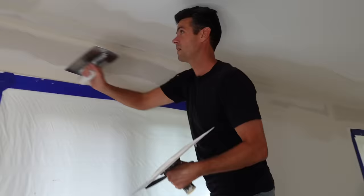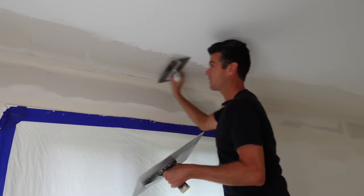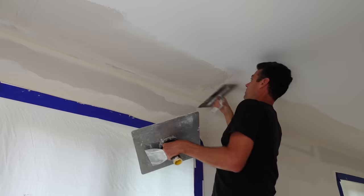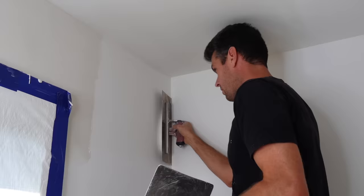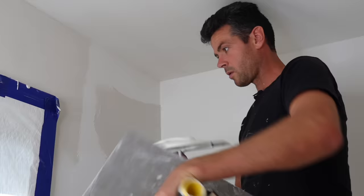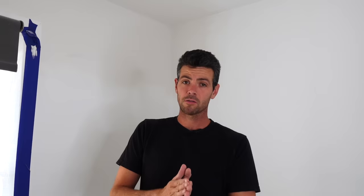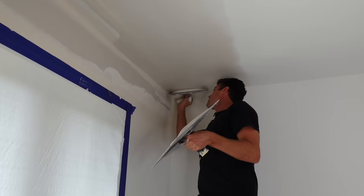I never actually ended up filming any more specific content for this video because that was about the gist of it. I did film two more videos related to doing the first coat and the second coat on this. After taping it was pretty simple — just coat, sand, coat, sand. Once you've got the tape on, plaster tie-in starts to get pretty easy. The only thing you really need to know is you're probably going to have to build it out pretty wide. That's part of the reason we do so much shimming in the beginning — to minimize how far you have to build it out. But plaster is never even and framing is never perfect, so it's going to take a little bit of mud to make up the extra.